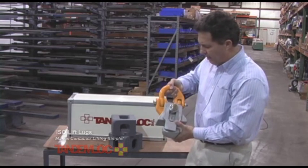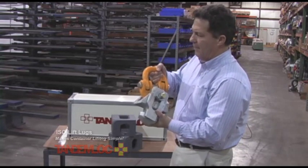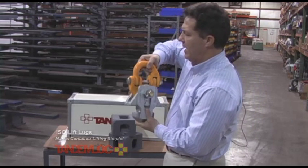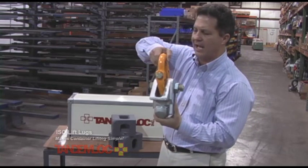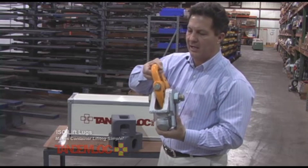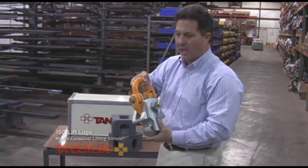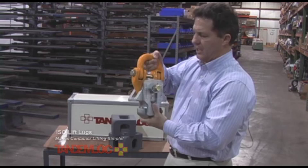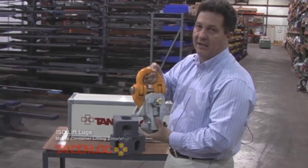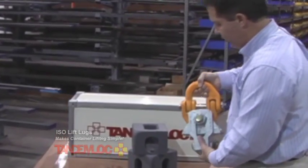To go into the use of this — very simple. It's comprised of a FlexLink, which is similar to a chain connecting link in appearance, but it is specifically designed to handle loads bent over. A chain connecting link is not designed for that, so it's very important to realize that we're not just taking a hammer lock or a connecting link and sticking it on our vertical lift lug — we're actually using a specifically designed chain connecting link.